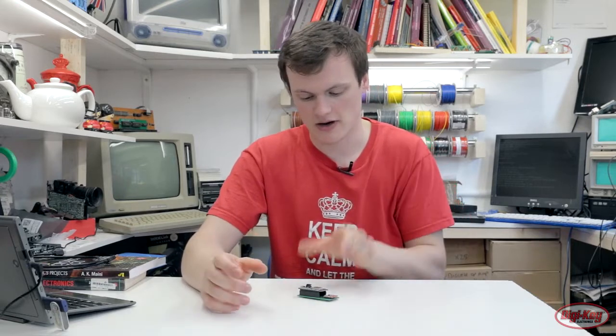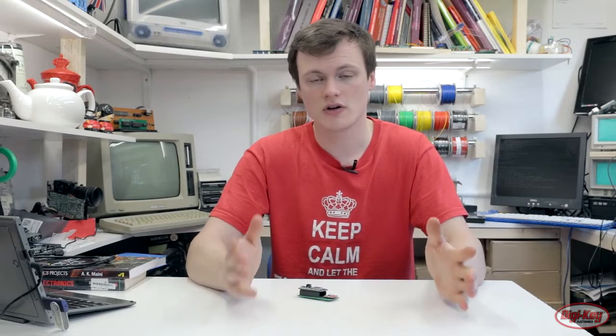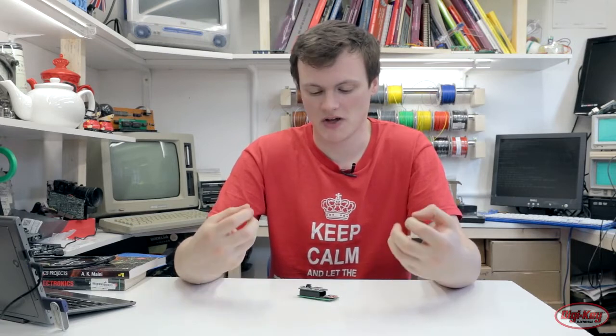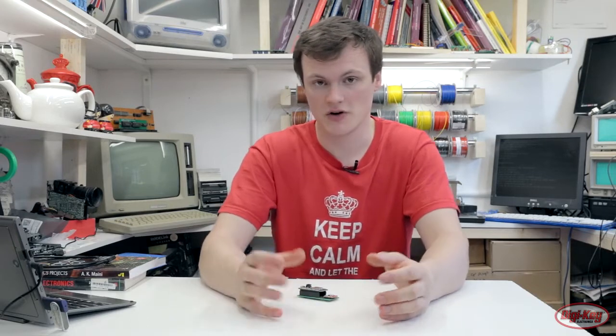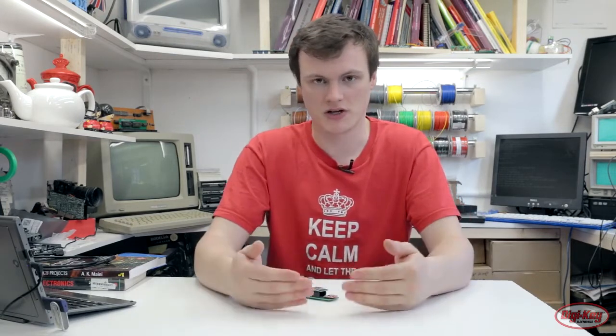The project is based around the Adafruit Huzzah, which reads the sensor and sends the information wirelessly over the local network. We use a local network because cloud services such as Adafruit.io are great for simple IoT sensors — temperature, humidity, door state — but when it comes to large quantities of data you would use up your allocated bandwidth in seconds. This system can send up to 50 packets per second, and a local network can handle that volume easily, whereas online cloud services cannot.